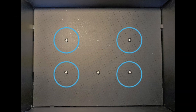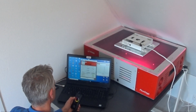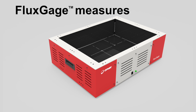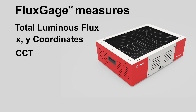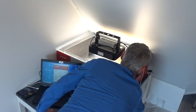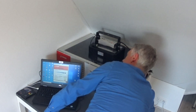By integrating four additional color sensors, the compact photometric device is now able to measure the color uniformity and illuminance distribution of LED luminaires in only a few seconds. FluxGage easily measures key light parameters such as total luminous flux, X and Y color coordinates, correlated color temperature, TM30, illuminance and flicker, and photosynthetic photon flux. The compact, sturdy, easy-to-use measurement device captures and calculates all of these important light parameters in a matter of seconds.